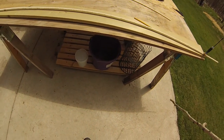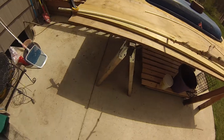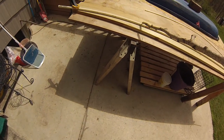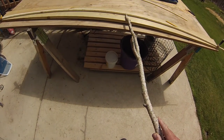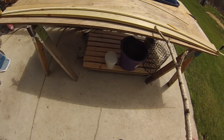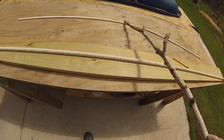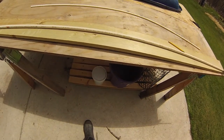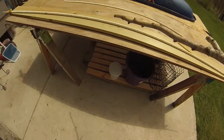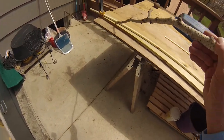Let's assume you wanted to put a curve in this 1x6 that followed roughly this pattern. This is just a piece of half-inch PVC piping that I've clamped at each end. After determining I wanted about that much of a curve — I could have curved it more or less. In fact, for smaller jobs when I want a lot of curve or even multiple S-shaped curves, you can use this quarter-inch PVC, which is very flexible. So all you're doing here is, once you get that clamped in place to your liking, you just take your pencil and trace out the curve along the PVC piping.